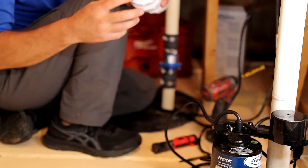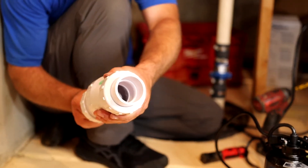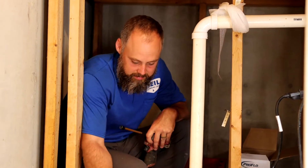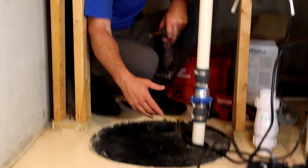You can see here — it's actually a little door in there that will open and close as the pump turns on. So to replace the pump, we have to access it through this lid. It has these bolts that are 7/16ths, and we're going to have to take those out and then lift the lid so we can access the pump.